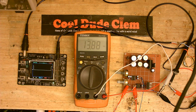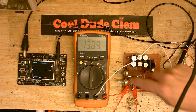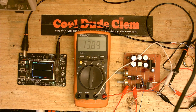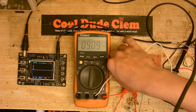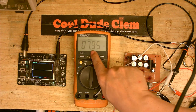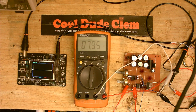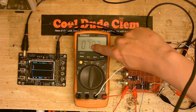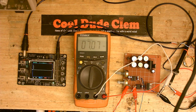What I've got now is: this one is still a 100 kilohm, and this one is a 500 kilohm — even though the original schematic calls for 200 kilohm. I think that's better, because I want the frequency of the interruptor to get down to at least 10 hertz, and with two 100 kilohm potentiometers that just wasn't going to happen. Now I can turn this all the way down to 7.95 hertz — let's see if we can make that any slower — yep, 7 hertz. That's working really well.